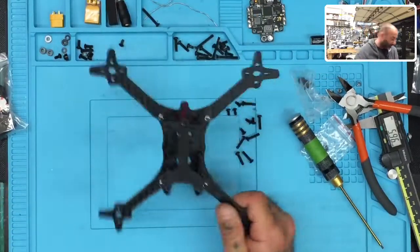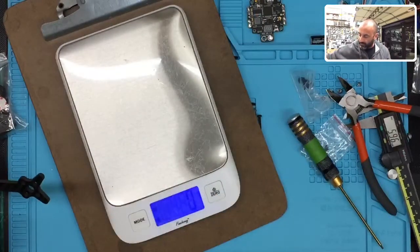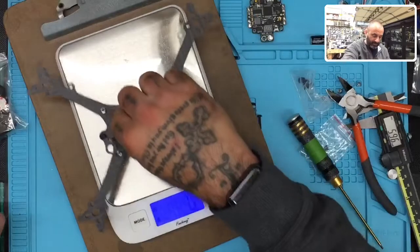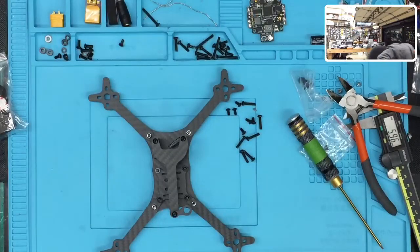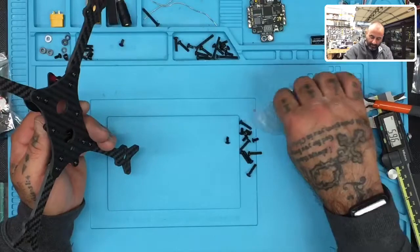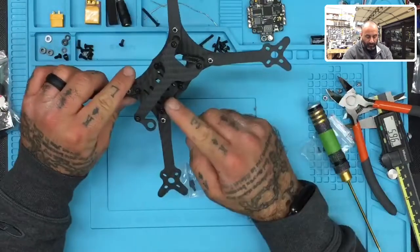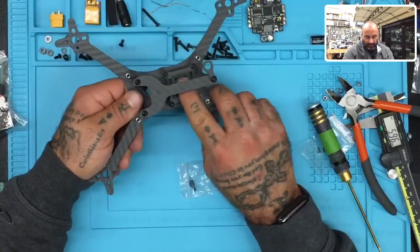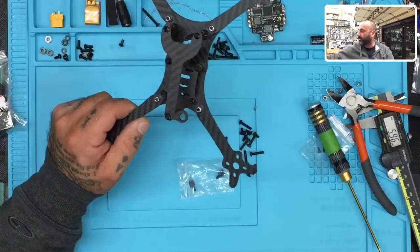So that's it — there's your frame. It's pretty light actually. Let me go on the scale. First let me grab a 50 gram weight to make sure it's calibrated — 50 grams. So now let's see how much this weighs — with everything like it is, 65 grams exactly. So this is a pretty decent frame right there guys, and it looks like it's going to be very sturdy. I don't know all the options for the screws and why they left so many in the kit, but we're pretty much out of pieces. They did give you some more standoffs — those could be used for the 20 by 20 or you can use a sizing plate. You can add your receiver or your VTX here and zip tie it or double tape it down. That's the build right there.